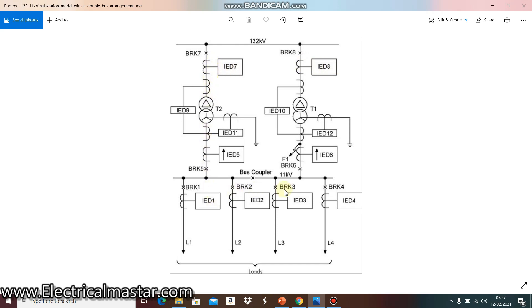These relays in the upstream substation RCP panel connect through cables to our substation — an 11 kV substation. Here we use step-down transformers T1 and T2 to step down 132 kV to 11 kV. The 11 kV secondary side connects to our 11 kV main switchgear panel, with bus A, bus B, bus coupler, and incomer breakers.